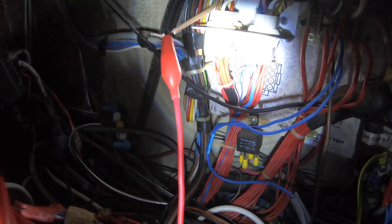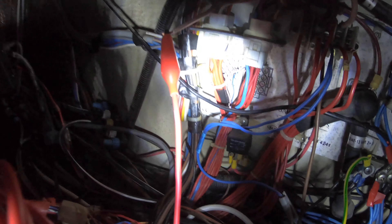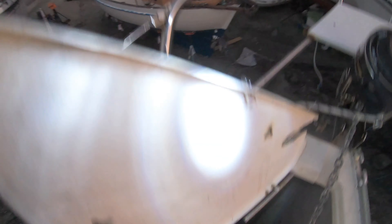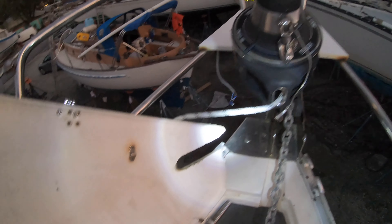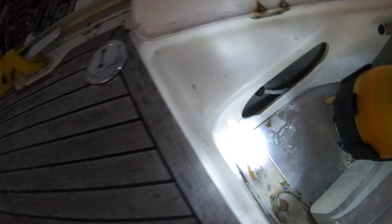Trying to mess with stuff back here — it's really crazy. All this wiring, not really sure what it is. Had to follow it back and we ended up finding this gray wire and a light brown one that goes into this coupling terminal. We ended up getting a power supply from Leslie so we can power it up and test each piece, each length. The nav light sits up there originally and comes down through the connector here. We tried cleaning those — they weren't working. We tested with the power supply from here all the way back up: bright light. Then tested from here back to where Alan's at — dim.